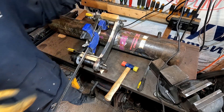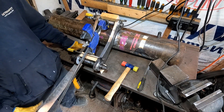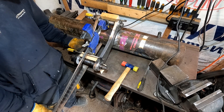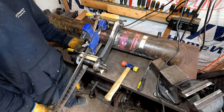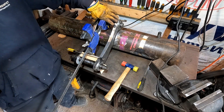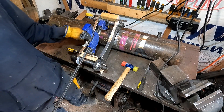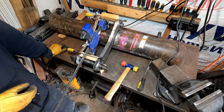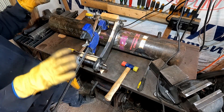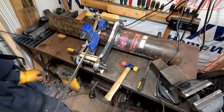And then C is rotation about the vertical axis, which I just set with a carpenter's square. It's a little tricky since everything is round, but I think the best angle is to come in underneath here and sight down the inside of the lug plate — and that is perpendicular. So this is ready. These three parts are aligned to one another the way that I want them, and it's time to start welding. There are a number of these little thought puzzles, because as pieces get added, I'm going to be doing some interesting things to make sure they're all aligned the way that I want them before I make them one piece. We'll be talking about that as it comes up.